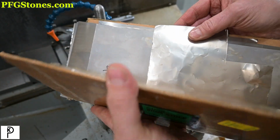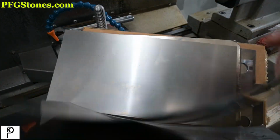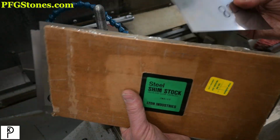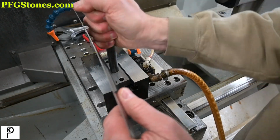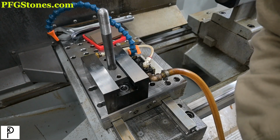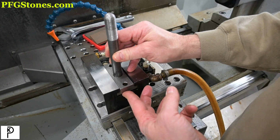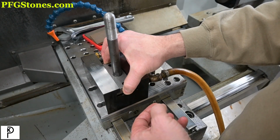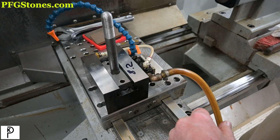We've got some steel shim stock here. Here's some 8.2. That sounds even more interesting. Let's do a little fit check with the 8.2. Oh, that's nice. That's not bad. So, okay, maybe 8.2 is nice, because if we make it too thick, it's going to end up being a pain in the neck all the time, right? So that 8.2 felt good. It's probably 8 thousandths nominally. And we measured about 9 thousandths. So let's say we're going to use that. That's going to be our choice for that shim.